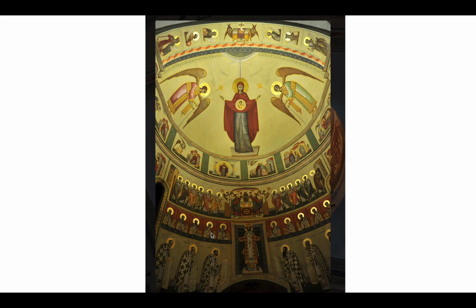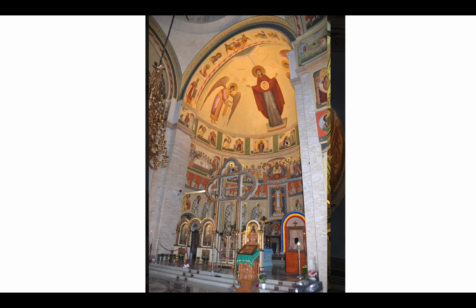And here we move on to the apse illumination, which I showed in the beginning. So here again, it was to highlight the painting on the ceiling. So it looks very good. I use the same product and same CRI of 90 and also a warm white of 3000 Kelvin. And here we have from the side a different view of the apse and how it's looking, let's say the final outcome.